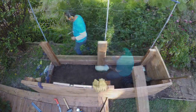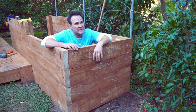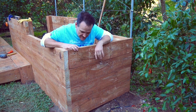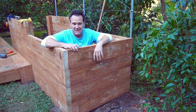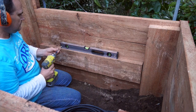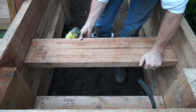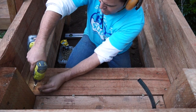At this stage it's important to leave one end open — just add the bottom panel. Now if you've been paying attention you're probably starting to wonder why I keep describing this as non-structural, because it's beginning to look pretty structural, and you're also probably starting to think that is going to take a lot of soil to fill it up. Well the fact is that what I'm building here is a giant planter box. The soil will only be around 300 millimetres deep. To achieve this I fix sleeper rails to the side walls and internal posts and then cut plates to size to span across. The plates are screwed off to the rails.